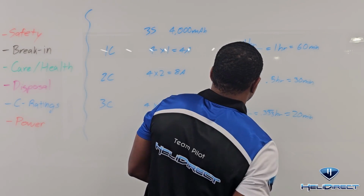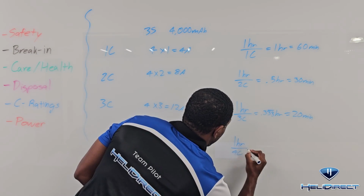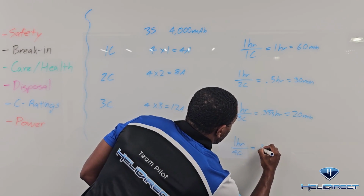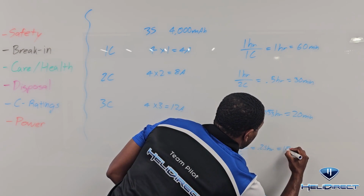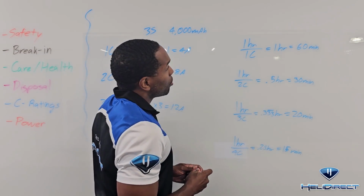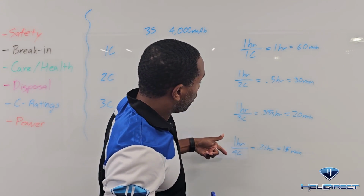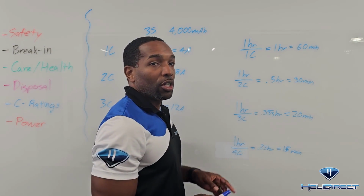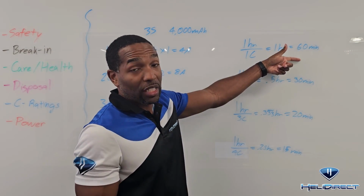And let's do one more. 1 hour divided by 4C. This is going to be 0.25 hours, and this is going to be 15 minutes. Now, I wanted to show this because, as you notice, the higher rates we go, we start getting diminishing returns. So going from 1C to 2C, well, we've just saved 30 minutes. That's a lot of time.